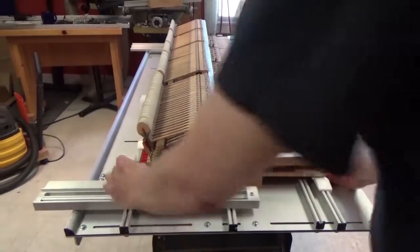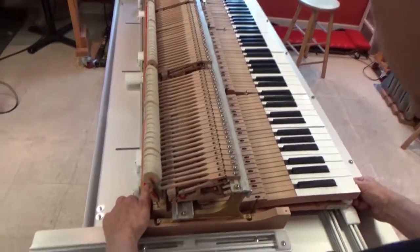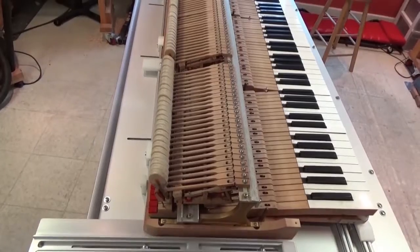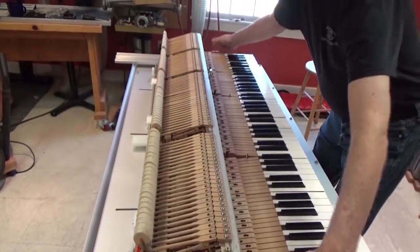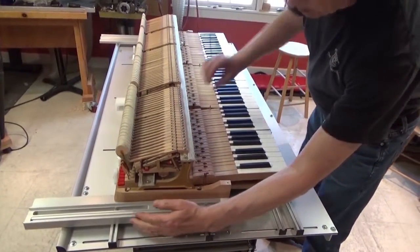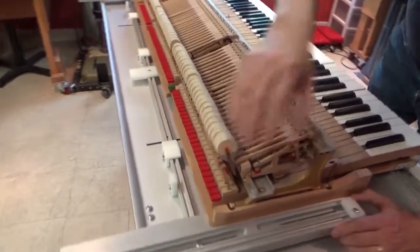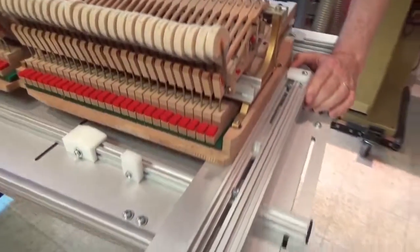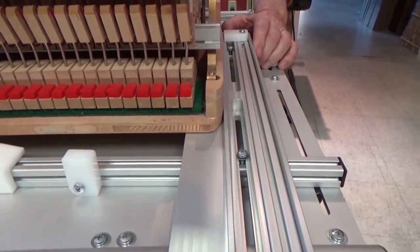So I'm going to wind this up. I'm putting the action in the middle of the station, so it's not over to one end or the other — it's right in the middle. And I bring the slipper tracks in to hug it. And I push them all the way back so I have more room for my squaring platform and my string height gauge.